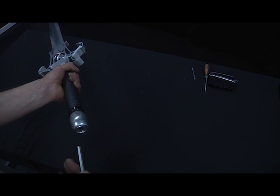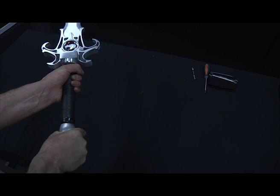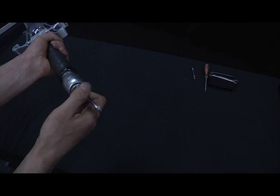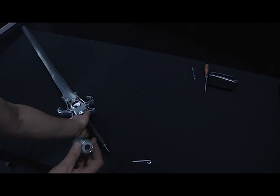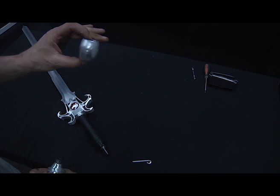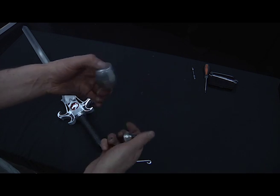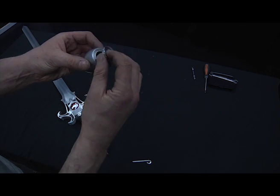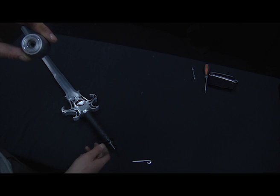Basically, this end piece was off a mountain bike — it's aluminium, with an allen key fitting just on the end. That comes off very easily. This other piece was found on a drinks optic system, the sort of bracket that holds it on. It had a big half-inch chunk sticking out of the side, so I've ground that off and filed it back — a little bit rough, but it's all right. This mountain bike part I've had to file down on the inside face so it fits nicely in there. This screw amazingly just happened to totally by chance fit the 6mm bar, so very lucky.